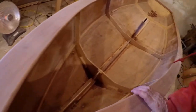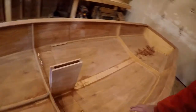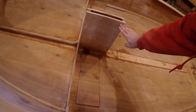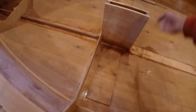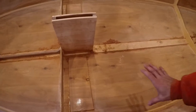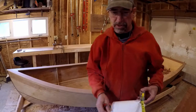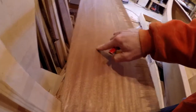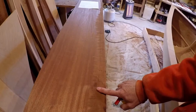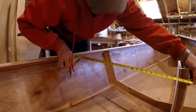Our rails are ready for finish, but it's too cold. So next step I think I'm going to tackle is the main thwart. We're going to decide how high we really want it, cut the daggerboard trunk off accordingly. It needs to fasten to R2 and come back from there, so it'll fit over R2. We'll decide how the side benches are going to fit into that — there are a lot of design decisions that need to be made. 11 and 3/8, hang over a half inch on each side. Notice this crack — that's not great, so figure out where best to take it out of this piece of wood and then right through the thickness planer.